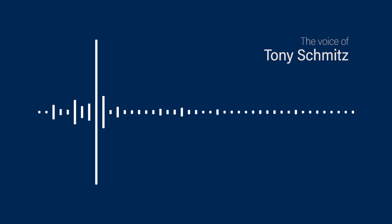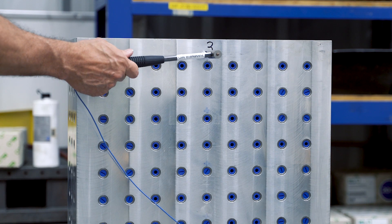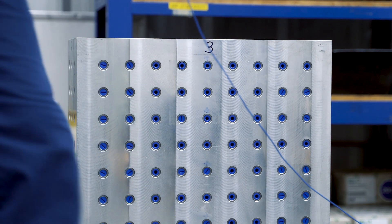In the first set of tests we were able to directly compare the behavior of these four different materials with similar geometries. When we machine — when we mount a workpiece on a tombstone and machine on that workpiece — the tombstone becomes part of a larger system: the tombstone mounted on the machine tool, which is mounted on the floor. It's that entire dynamic system that governs the machining behavior. So we wanted to verify that if we put four different tombstones on the same machine tool and machine a workpiece on each, we still see the same trend and behavior that we saw with the tombstones alone.